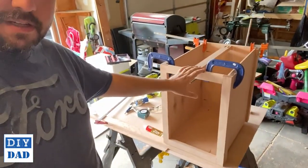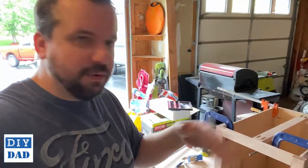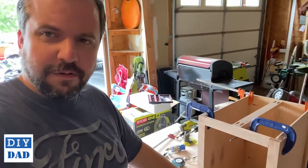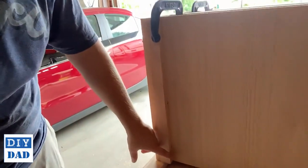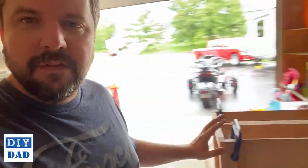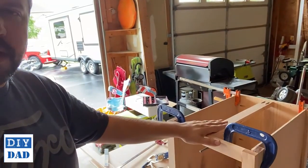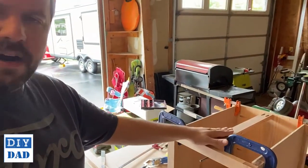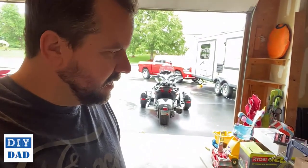The main cabinet is done and clamped because I've been gluing the sides on. The bottom is held by friction with the channels cut in the sides — it's kind of wedged in. The top is held by liquid nails glue and I've had it clamped overnight, so those clamps will come off. I ended up putting a piece across the top just to keep the box square and give it a little extra support, since it's going to be one of the main supports for the table itself.